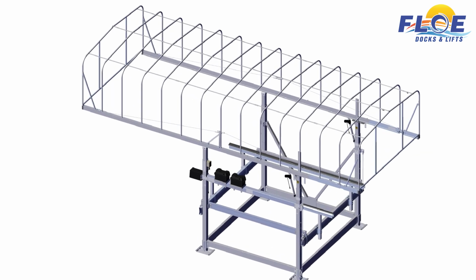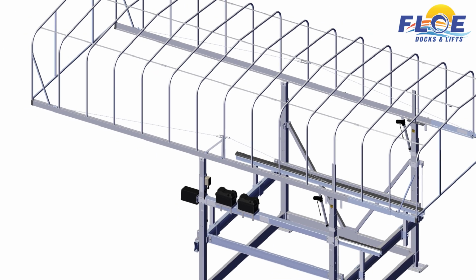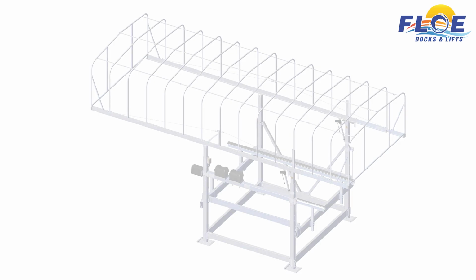Note: if you run out of adjustment thread while tightening the cable, back off the adjustment screw all the way and move the canopy support further forward toward the overhang of the canopy. Retighten the fasteners and make adjustments according to the previous steps. After installation, check the cable periodically to ensure that it is still tight and that all hardware is secure.